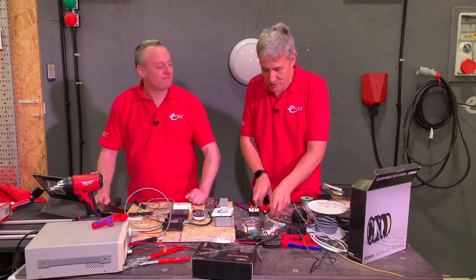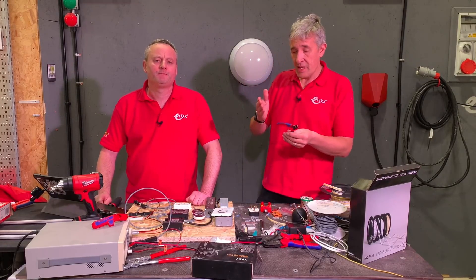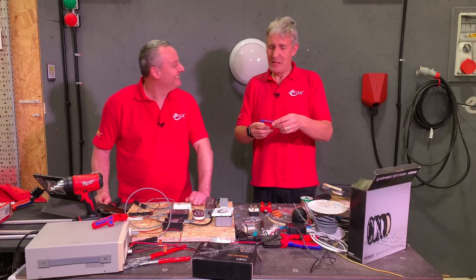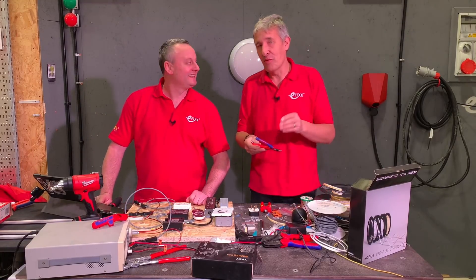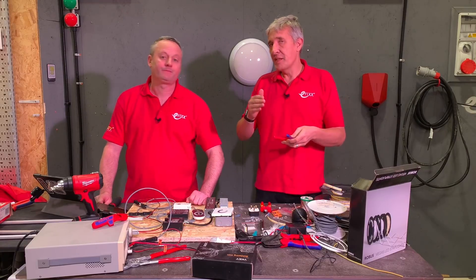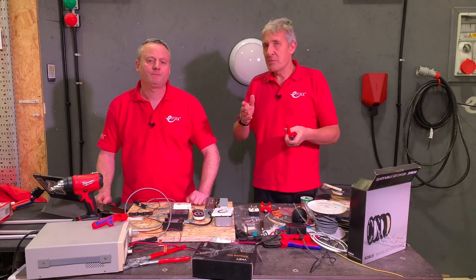These are great. We've picked the 140 version — we love a part number — so this is the 7861-140, the 140 being the length of the cutter: 15 millimeters longer than the standard one. We think that's probably the best for an electrician who wants to use them for purposes beyond just slicing plastic cable ties.